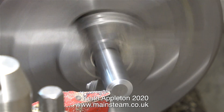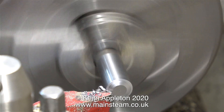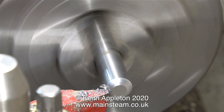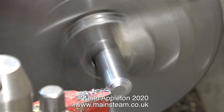So now, without further ado, it's over to the lathe, and the piece of silver steel is in the chuck, and I'm going to make this into the missing drive pin. It's a simple, plain turning job. I have the original drive pin on top of the headstock, and I'm copying the shape of it onto the piece of steel in the chuck.